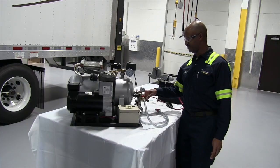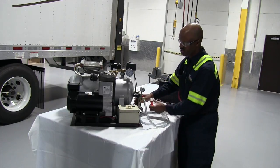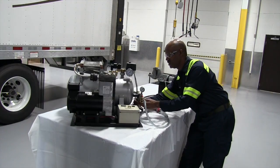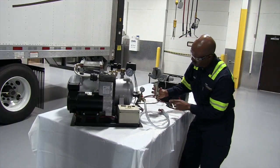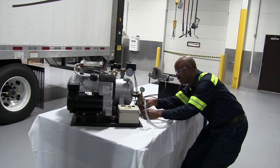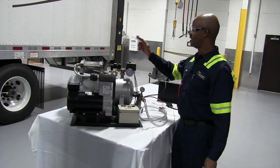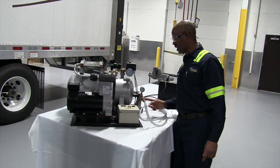Check your filter. When changing the filter, make sure there is no pressure in your system — if there is, let all the pressure out. Pull down, twist and turn. These filters should be changed annually, just check the condition of the filter. There is also another filter behind the tank that should be changed the same way.